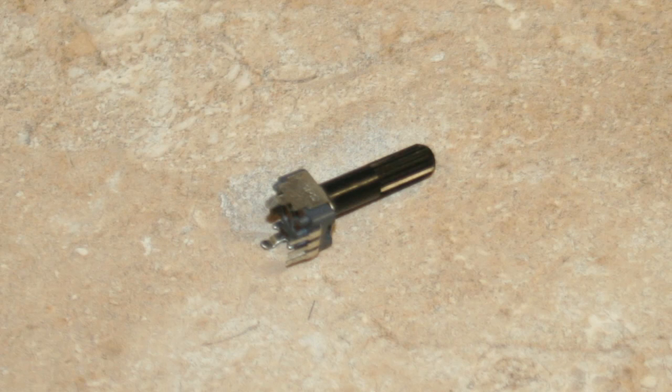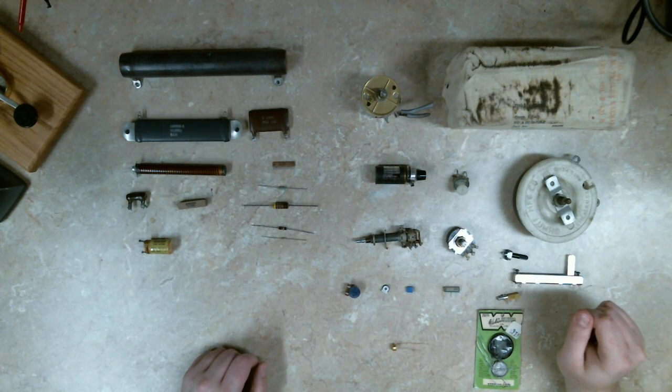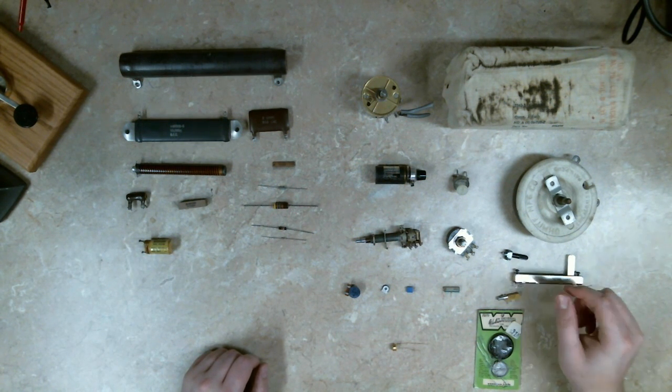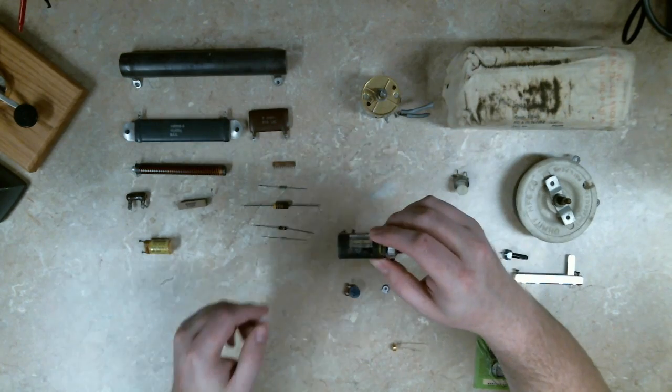This right here is something you might actually use. The bad part is the only mechanical connection is solder and your copper traces, which can break easily. There's a smooth spot on it that can be used as a bearing — you put a plastic face plate tight around it, just tight enough to turn, which gives mechanical support. These are commonly used on Arduinos and microcontrollers because the pin spacings are small, they're out of the way, relatively well built, and they're cheap.